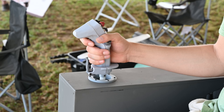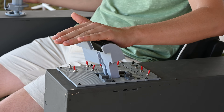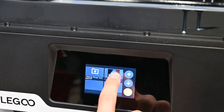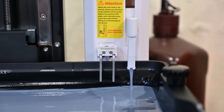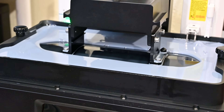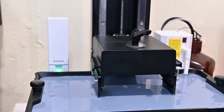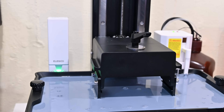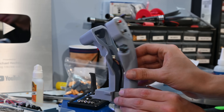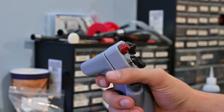To actually fly a plane with this I needed some controls — in this case a joystick and a throttle. I could just buy these but they can be a little pricey, so I decided to make my own. I found a model of these A10-style controls online and then resin printed them on my Elegoo Jupiter, which is just a giant resin 3D printer. Printing in resin works great because they don't need to be structural parts, and the small layer lines make it really comfortable to use. After everything was printed I added some buttons and switches, which are mostly just for aesthetics but can definitely be mapped to different things in the future.